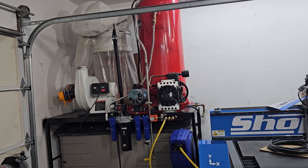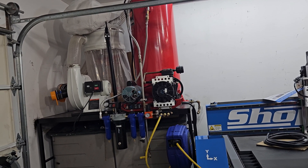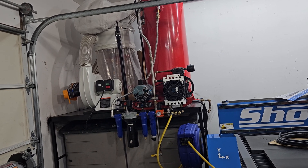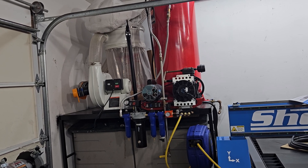I built a platform, I mounted the tank, I welded the actual motor bracket with compressor to that platform, and then began designing my air filtration setup, my drain valves, and my charge air cooler for my air system.